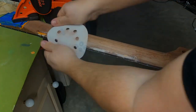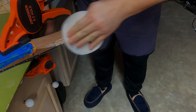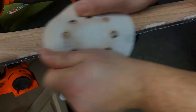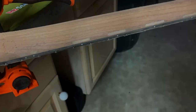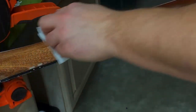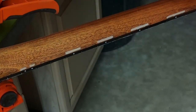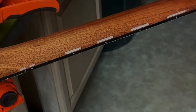I knew I was going to do sanding to this anyway. Here's the sanding — you can see some tape sticking off the side that comes off no problem. I'm using 120 grit sanding disc that I'd normally use on a random orbital sander, but using it by hand. Going up to 240, then 320. Here is some naphtha that I put on the neck and it just looked amazing — that sapele looks so good. The channels themselves are a little sloppy, but really this was the best I could do without further damaging the neck.